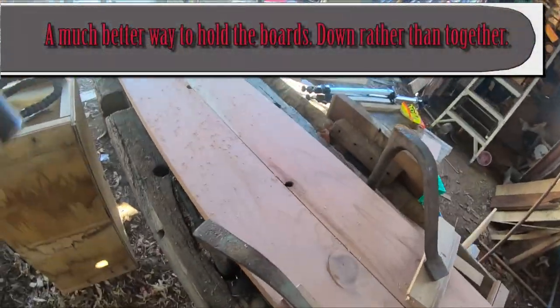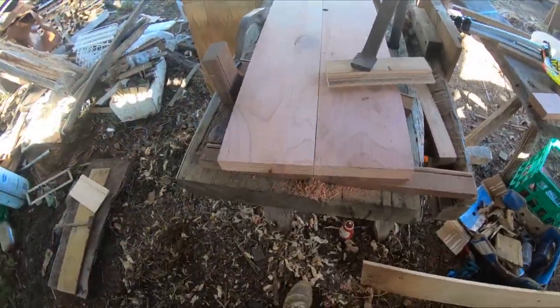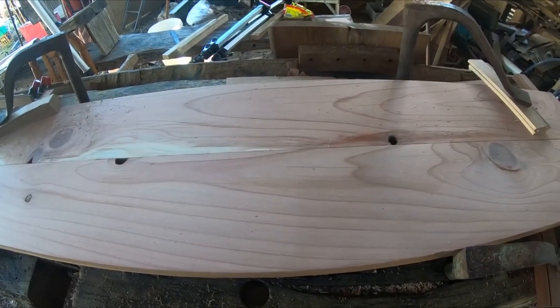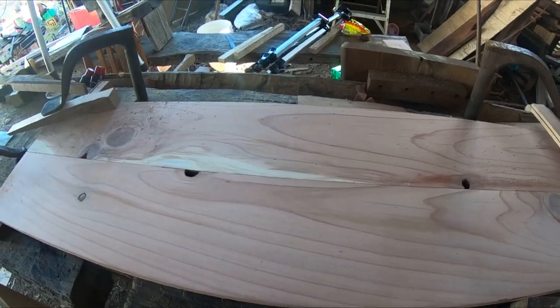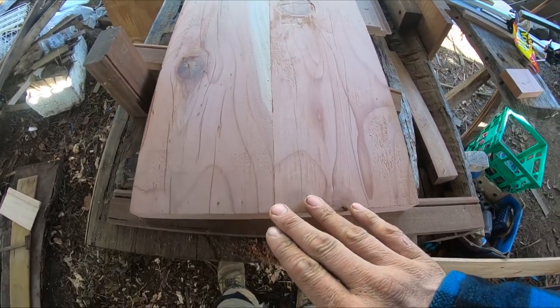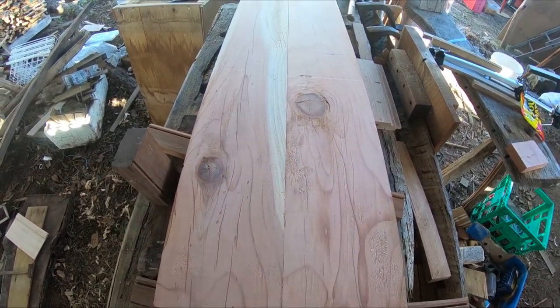How well does that work? It's better, but I'm not happy with this. You can see I've got some wobble in my saw and a wider cut here. I reckon it would be better on the other side, so let's turn it over and have a look. Lesson learned: you do it from the bad side, or the side you're not going to see, because that's a much better fit — of course that makes sense in hindsight.